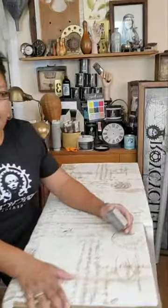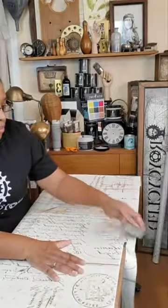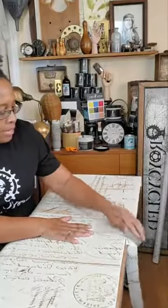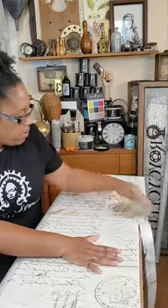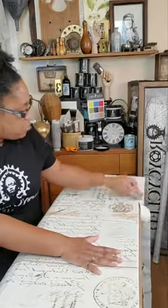I'm going to slide this closer so you guys can see. Notice I'm sanding away — I'm not going back and forth, I'm literally only going one way, and that's away from the table. It is literally trimming it right off and leaving me this perfect edge all the way around. This is a 120-grit sandpaper. If I used 80-grit, it would probably tear my edges — which, if that's what you're going for, that's awesome. But I didn't want to use 80-grit. If I used 220, I would be sanding forever. So really the 120 is perfect. Also, the varnish dries really fast, which is another reason why I only do a section at a time — you want to make sure it's wet when you're laying the paper on the product.